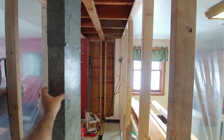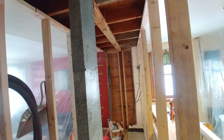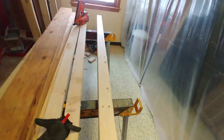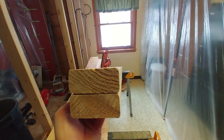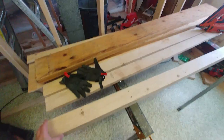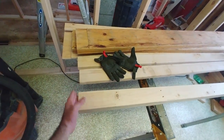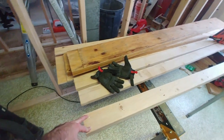But when it comes to putting together two 2x4s to stand underneath this end, I wanted to laminate them or join them, but they wander a bit. They weren't completely straight, but I do want a nice coplanar surface all the way down. And rather than wrestling and digging through a pile to make sure I had perfect ones, I started at one end. So I got this end flush, and I got the sides flush, and I put two nails in here.